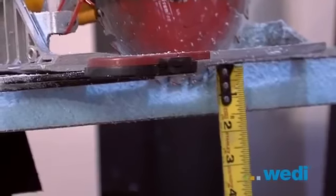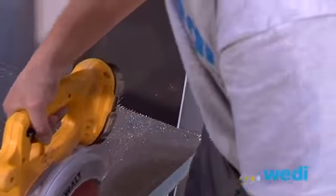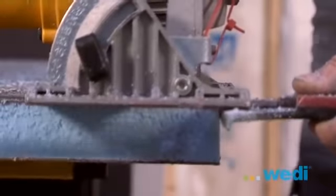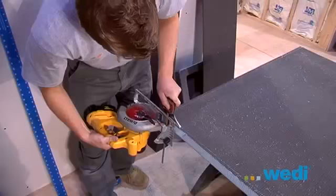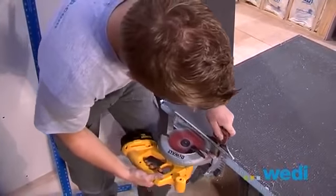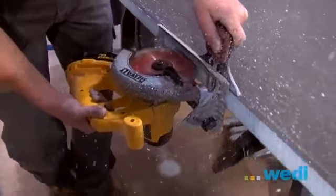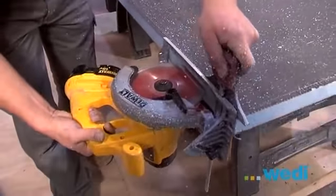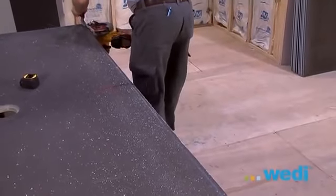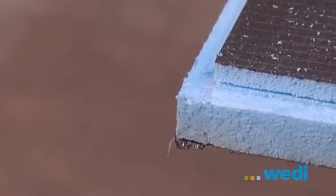Once the base is cut, you'll need to recut the 1/2 by 1/2 inch notch on all the perimeters. Do not skip this step or the system will not work. Readjust your saw blade depth to 1/2 inch deep and cut the top of all the straight base perimeters 1/2 inch inset from the base edges. You'll now roll the saw on its edge and use the guide to make the horizontal notch 1/2 inch down from the top surface. You can also make the cuts with a straight edge and razor knife if you don't have power tools.